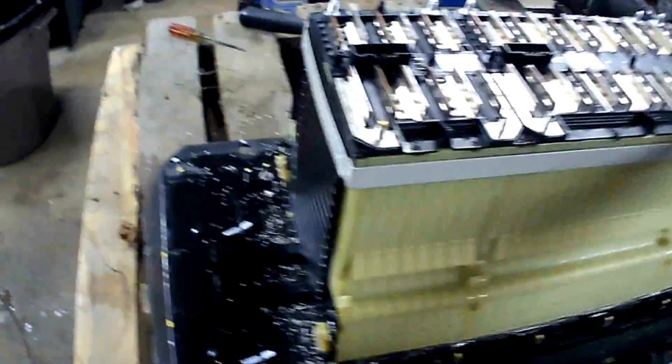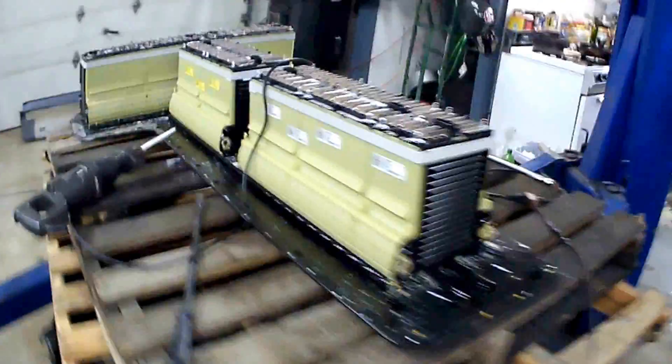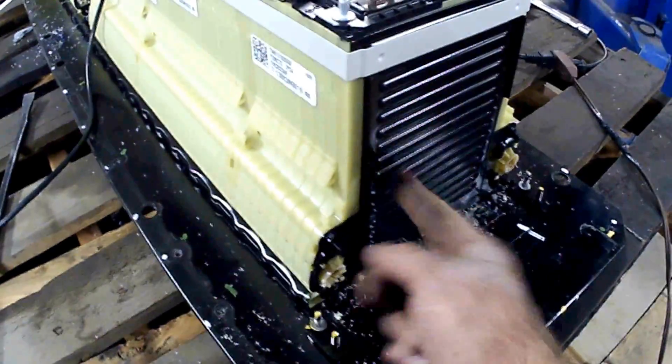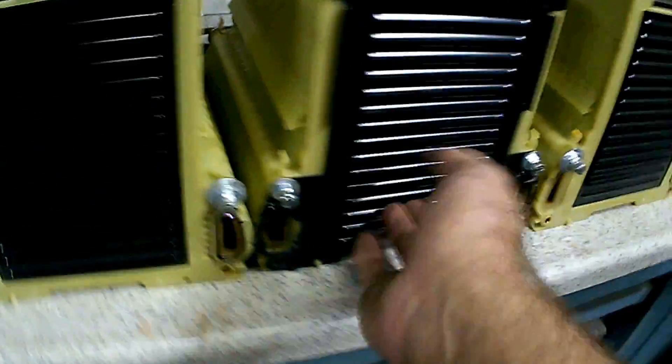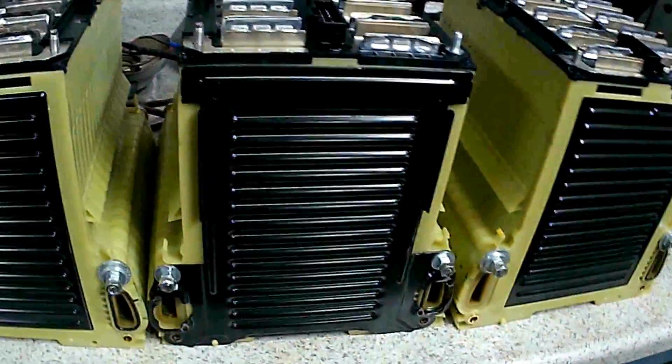When you get the top covers off, there are plastic covers you have to pop off, and there are little bus bars between the modules that you take off — just run the nuts off and remove them. I saved a pile of them in case I need them. I also knocked that nipple out of the end plate so it looks clean when bolted back on. You won't have enough metal end plates for all of them, but where you do use one, you won't have an ugly sawed-off nipple sticking out.